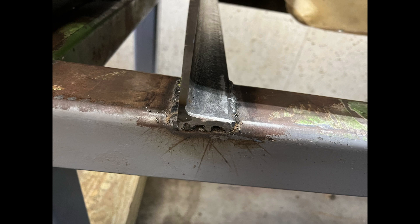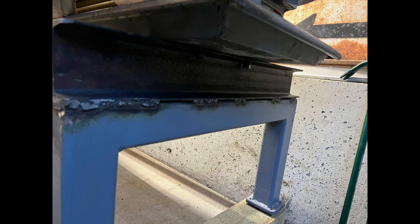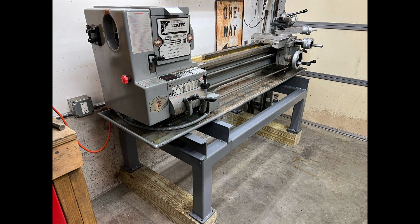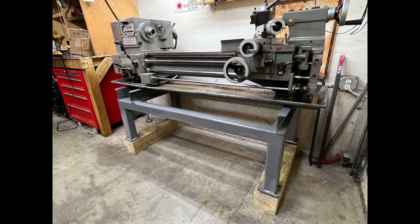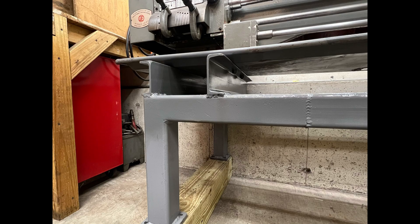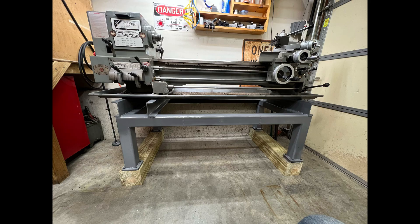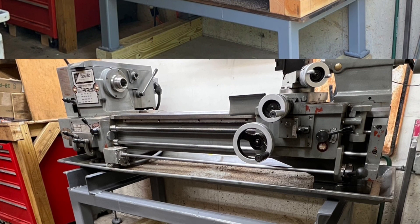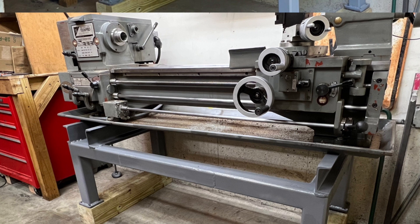From here, I took the C-channel, put it on the metal frame, and welded them into place. What you can see is where the bolt holes are, so I can actually mount the lathe to the workbench — something I couldn't do before. Here are a couple of glory shots with the painted steel looking really nice. Just being able to bolt the lathe down, as opposed to having it sit on the wood, made a world of difference in how the lathe actually felt when I started it up and ran it. I've got a good foundation, and in our next video I'm going to walk you through how I aligned it using a level and a tape trick.